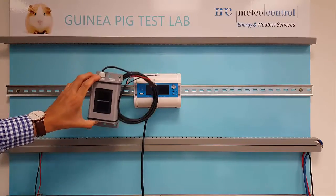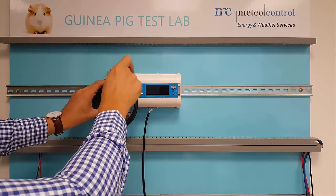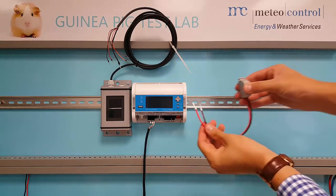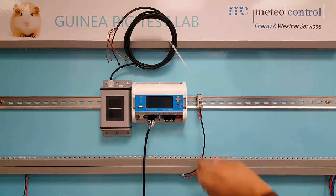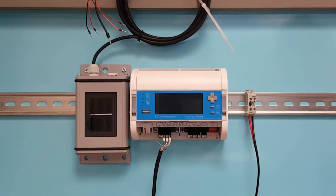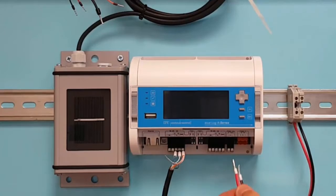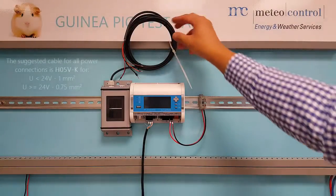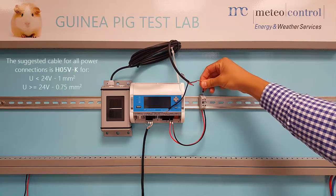This video will feature how to connect a solar irradiance and temperature sensor. For demonstration purposes, we will mount our sensor on a test wall. In a real scenario, you will do this next to your solar panel array. To maintain tidiness and maximum shielding of the cable, we recommend using a DIN rail screw terminal to provide connection to the power output located on the bottom of the Bluelog. Connect the red wire into the positive and the black wire into the negative terminal. From the sensor, connect the power — that is the red and black wires — into their respective DIN rail screw terminals.